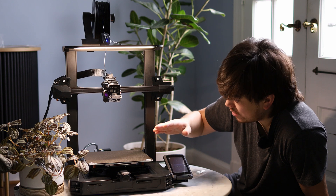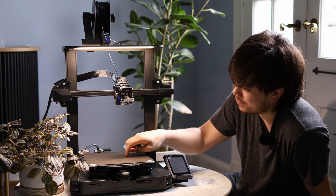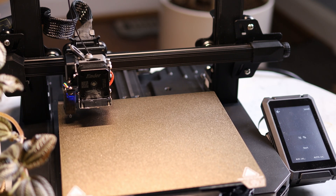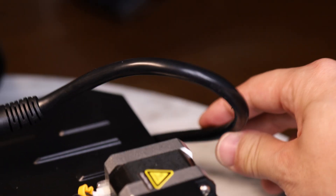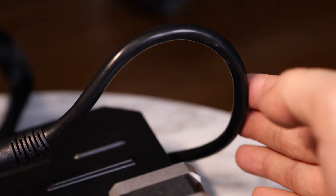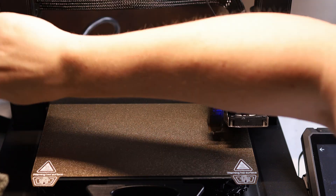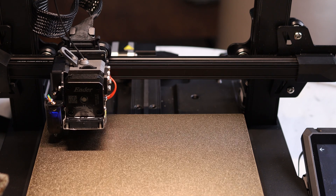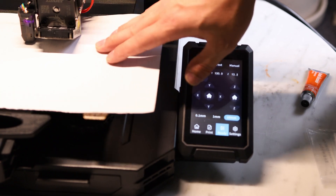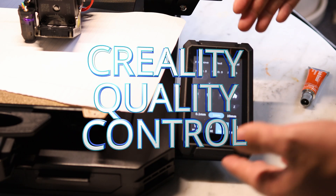Let's get to printing. With the SD card plugged in I'll run the bed leveling procedure. Through the touchscreen I can access a leveling menu and it's going to come down and touch the build surface, probing a bunch of points on the bed. It actually just got caught right here on the edge of the stepper motor — it kind of wants to droop over and get caught there, almost ripping a chunk of cable out. The instructions on the menu aren't super clear, so you'll probably have to read the instruction manual to get the bed level set up correctly. There also seem to be some firmware bugs they need to work out, though we'll probably get open source community firmware that's better anyway.